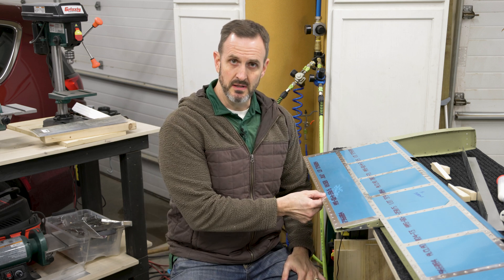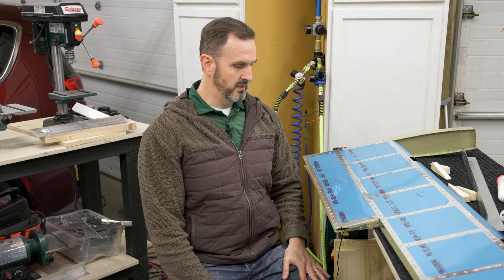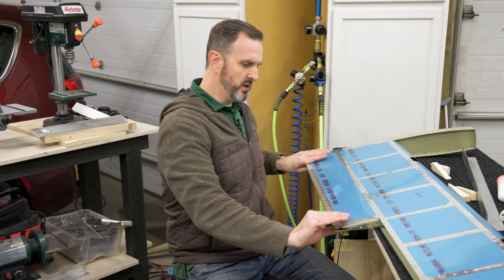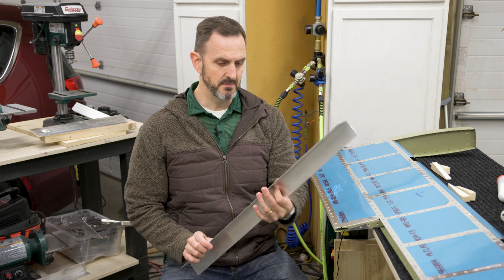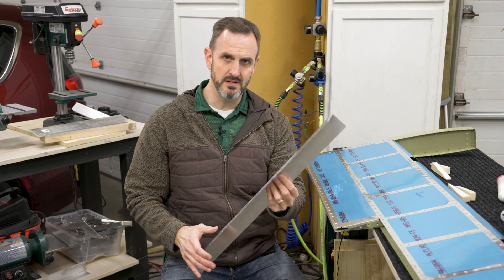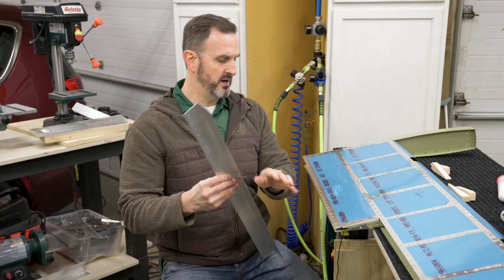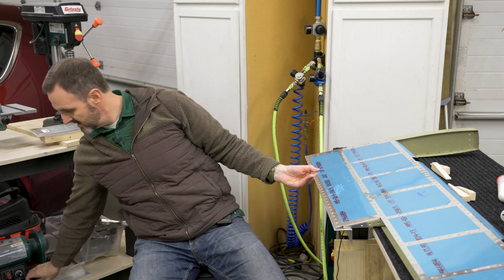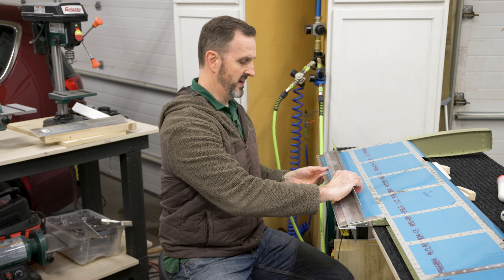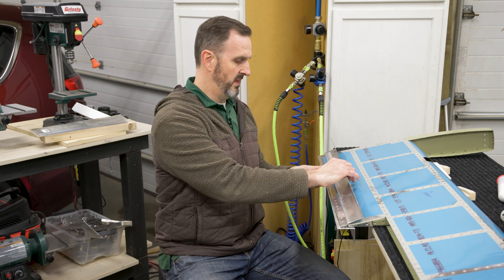When you rivet it, it's less likely to warp or not be straight. It's probably more of an issue for things like the rudders or some of the wings where the trailing edge is longer. Anyway, the plans say maybe put some wood here and clamp it together, but some of the wood I bought isn't straight itself and I don't have a joiner. So I went to Lowe's or Home Depot and got some aluminum angle - I've measured it and it's pretty straight. I've drilled some holes along the edge, and after I put the Pro Seal on I'm going to cleco it against this and then take another piece of aluminum angle and clamp it together, so hopefully it will cure nice and straight.